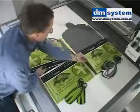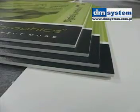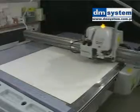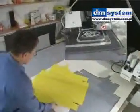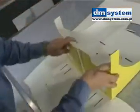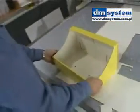The multi-cut tool head expands the material range of the XL series to include compact, heavy and sometimes thick materials that cannot be cut with a knife. The multi-cut is unique because with one single tool head, material all the way from corrugated and cartons to glass-hard sheets of thick plexiglass can be processed. This kind of versatility is ideal for sign and POP display customers who frequently use rigid materials for signage and permanent and semi-permanent displays.